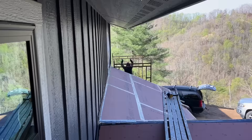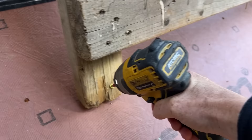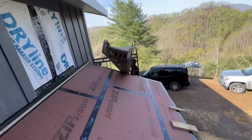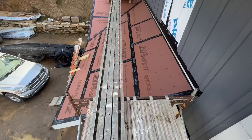The bad news is the guy who was supposed to bring the shingles on a boom truck and set them up on the roof got sick, so now they're just gonna bring them on a flatbed and we're gonna have to carry them upstairs and hand them up on the roof. Our first move is to scaffold up so we can get a walk board at the right height across this whole thing, get our drip edge on this upper level, and our starter row of shingles without having to lean down toward the edge of the roof while standing on it.